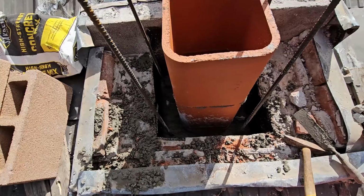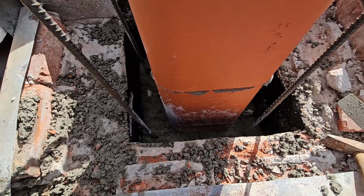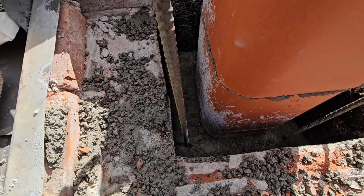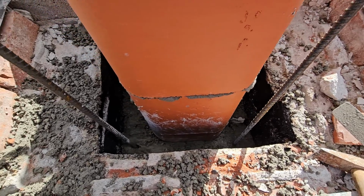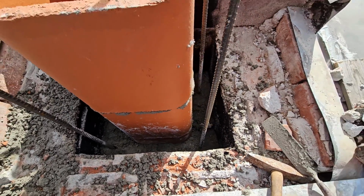What we did down in that hole is there was a little lip down in there, and we just straddled some number 5 rebar across it to hold the flue tile while we poured this concrete in there. And that's about a foot thick right now. I just don't dare put too much in there, it'll probably drop out the bottom. So we do that much and then let it cure, and then it should grab a hold of that good enough to continue building the chimney up.